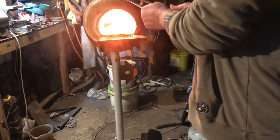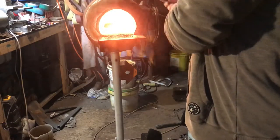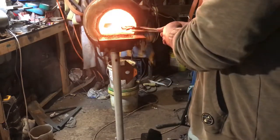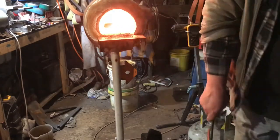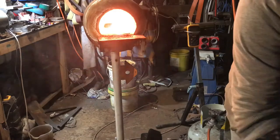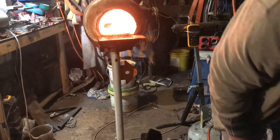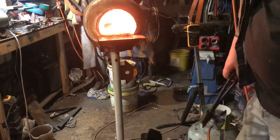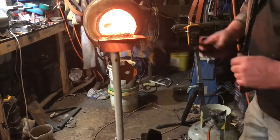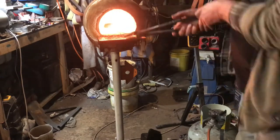This is a lot quicker process than the 12C27 stainless steel that I've done in an earlier video. Basically for carbon steels, we're just going to bring it up just past non-magnetic — a little bit past non-magnetic is the critical temperature.